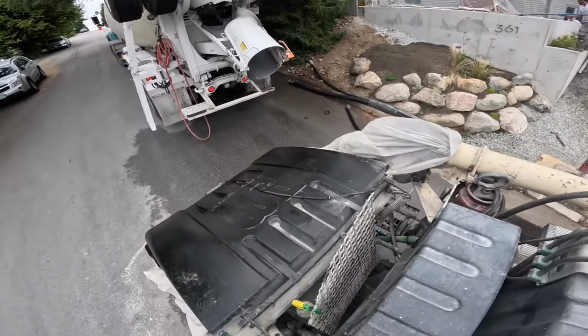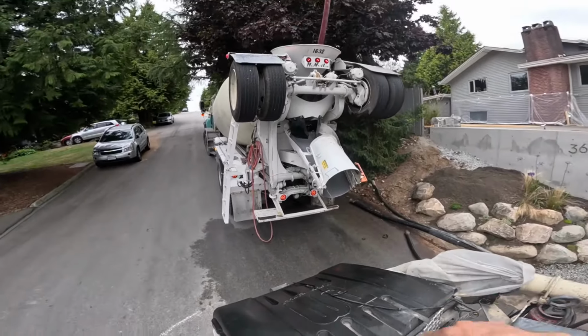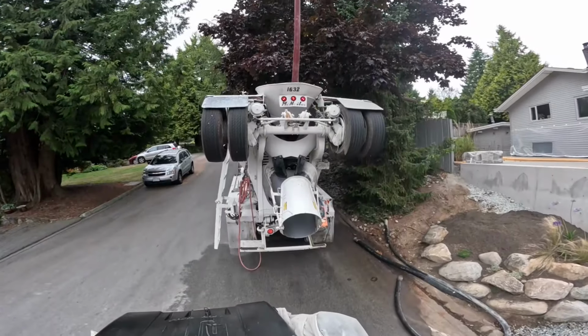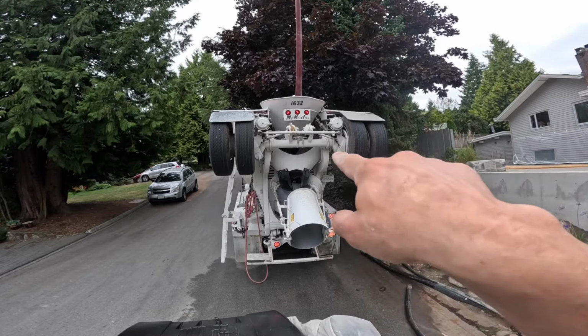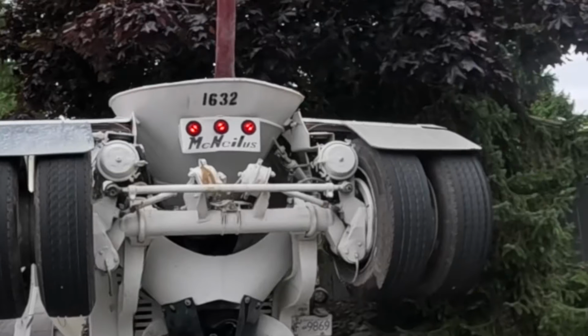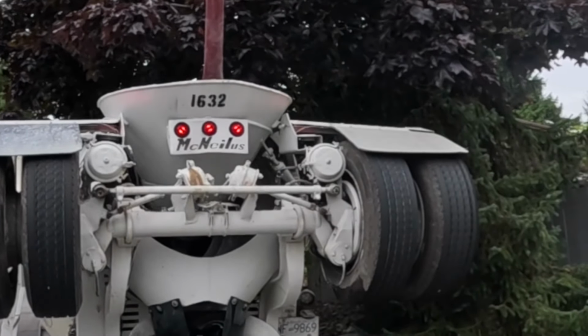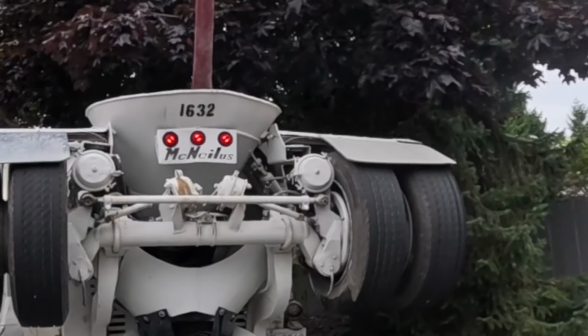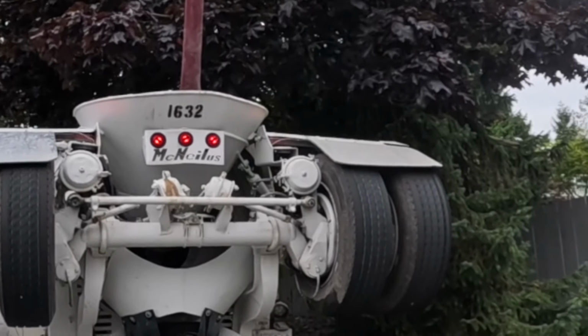And I'll just continue pumping out, get a little bit of air through, and then we'll bring the boom back down. Pull our sponges back, easy peasy. The lay flat hose, I do like to be up here where I can see into the drum there and see that I've got flow coming out of that hose to make sure that it's not kinked. God forbid if it were to kink and we push air behind it, poof, bad things would happen. So it's a good vantage point right here.